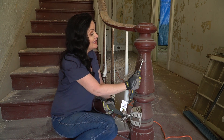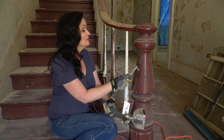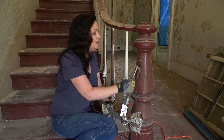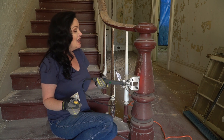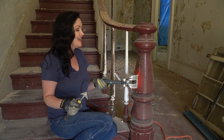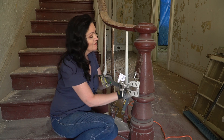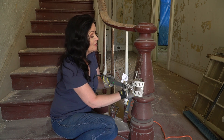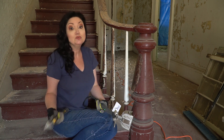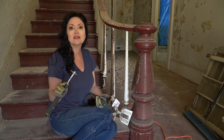I hate chemical strippers — they make a mess. I've never really had a lot of luck with a chemical stripper because even organic strippers make a lot of mess and they tend to open the grain of your wood a little bit. Anytime you put a liquid on wood, it's going to open the grain and you're going to lose a little bit of the beautiful finish on antique wood. Part of what makes antique wood so gorgeous is that tight grain and the smooth wear patterns in the finish — and you lose that when you apply chemical strippers and then mineral spirits. That's one of the reasons I do like a heat gun when I use one: you get that paint off without opening the grain.